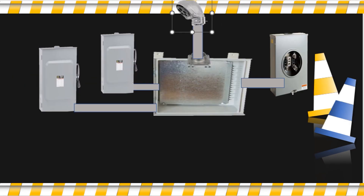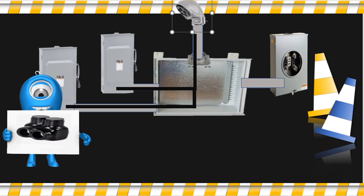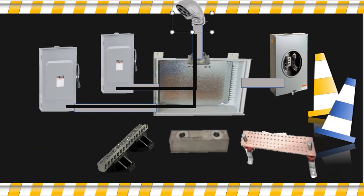Let's take a look at our connections, then we'll take a look at some of the utility connections. Let's imagine that we have two hots and a neutral coming out of our riser, but let's deal with one wire at a time. This is our black hot coming out of the riser. We're going to need a black hot going to panel A, and we're going to need a black hot going to panel B. And then, of course, we're going to need some way to splice this all together. One way that we can do this is with an insulated lug. They're a little bit more expensive, but they're very easy to use and a very rock solid connection. You can also use any one of these other methods or any other method that your electrical inspector will allow that is a Chapter 3 wiring method. There are a million different ways to do it and there really is no wrong way. So let's imagine that you decided to use the insulated lugs — once we got this far, we would use our insulated lugs, make that joint up there, and then follow suit with the neutral and the hot.